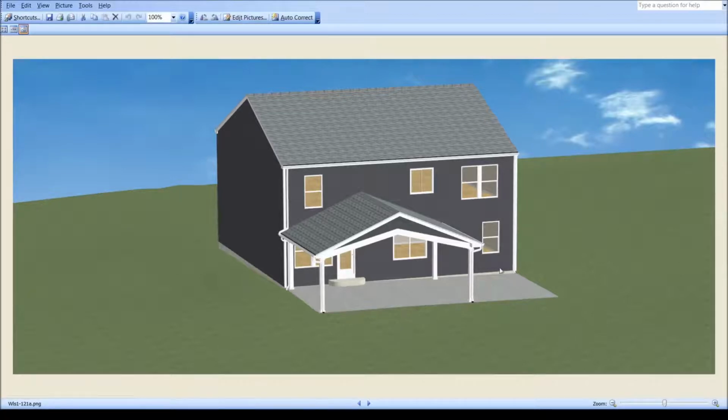Note that I know that the grade here is down 9 inches from this siding here. And the way I've got it, it's coming over pretty much level to about here, sloping down at 3/16 per foot, and that still puts this at about 5 inches, which means even with a 4-inch slab, it's just on top of the grade there. So there probably is going to have to be some filling and grading around this, but this should work.